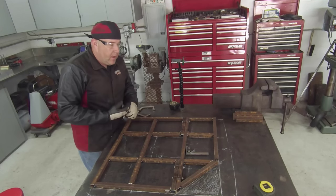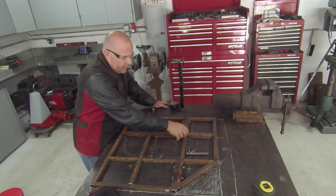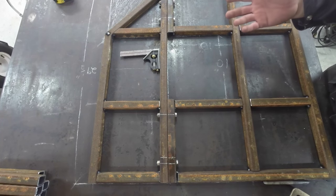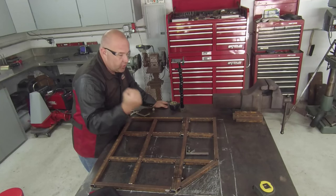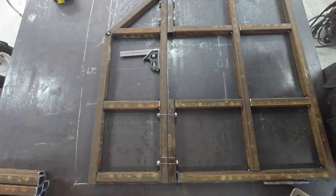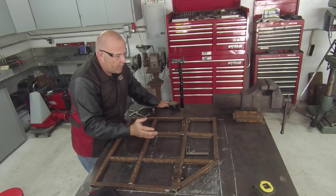Now that the whole thing is tack welded together — if you're an experienced fabricator you already know that when you weld on one side of a joint, especially a T-joint, it's going to pull toward the side you're welding on. If you aren't experienced, let me explain why: we put the MIG gun in, squeeze the trigger, it sprays liquid hot metal into our weld, melts the base metal, raises it to melting point, and it quickly freezes as it cools. When it cools it contracts, and when it contracts it'll pull everything out of square.